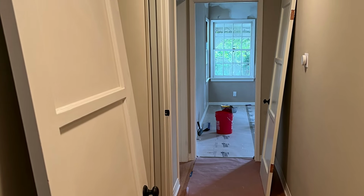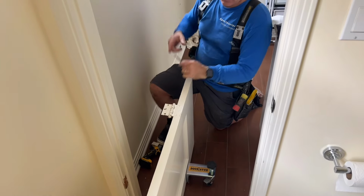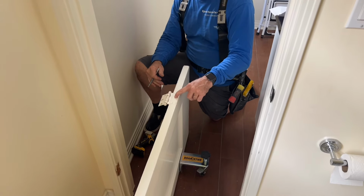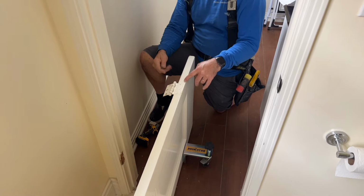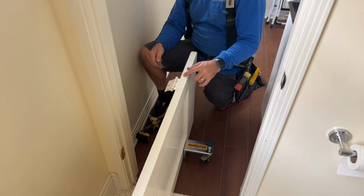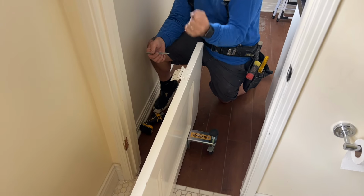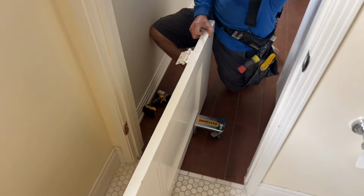If you're working on a house from the 20s, 30s, 40s, maybe even 50s, the chances are that if it has not been remodeled, the hinges on the doors have been painted over many, many times, and that makes it hard to replace the hinges. In this case, I slid some door supports, some door studs, underneath the doors and lifted them up enough that, in anticipation of getting the doors loose, the doors wouldn't destroy the jambs.